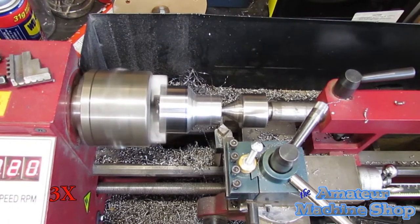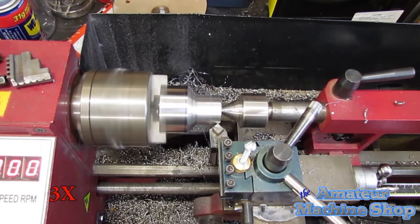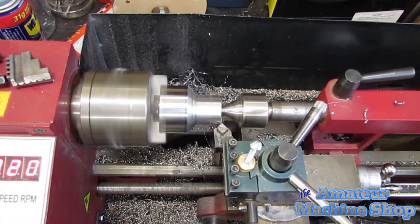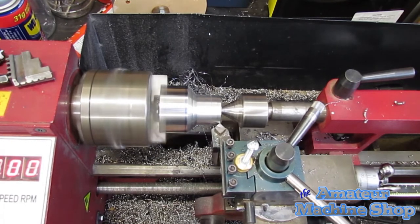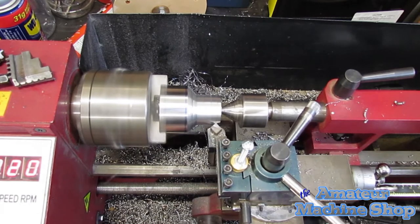While machining the 2-inch shaft, I tried various RPM to decrease the chatter. Going higher or lower didn't make a noticeable difference. The lathe isn't built solid enough for heavy roughing, so light cuts will be the only solution to keep from tripping the spindle.